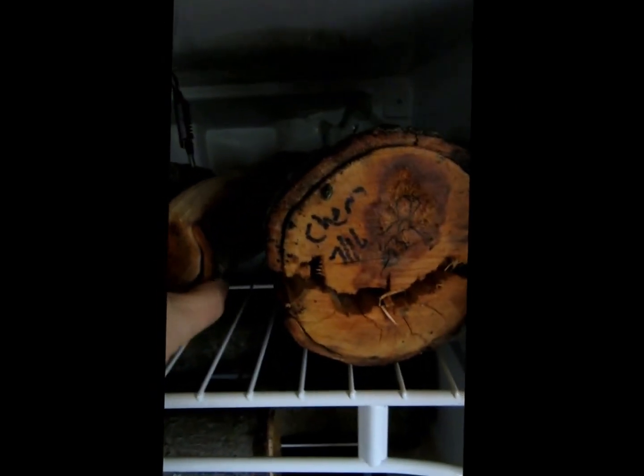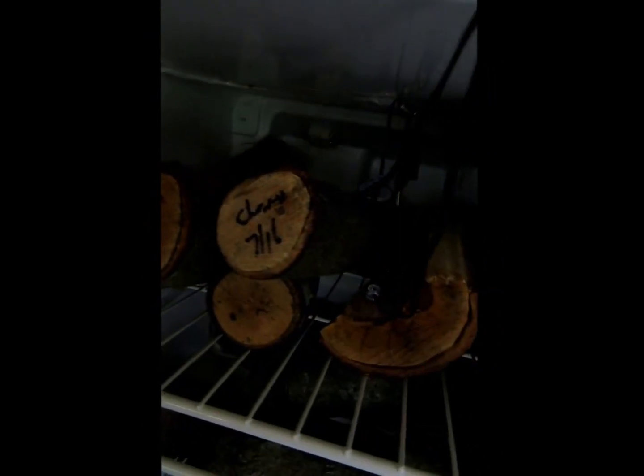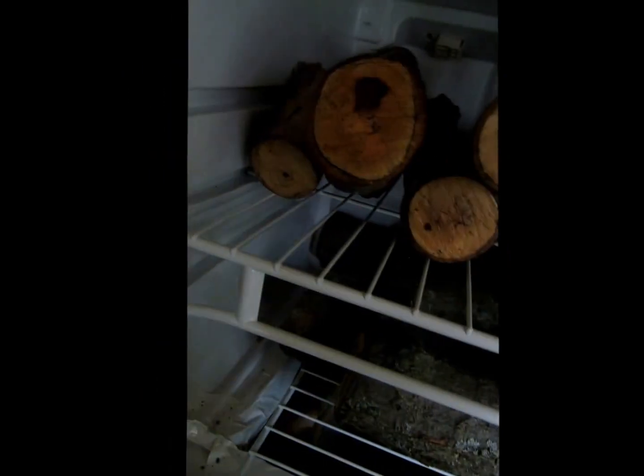The rest of these pieces have come down substantially in moisture. I was checking them and like this one is 10. I've got a moisture meter — poke it in. I was getting down to 7–8 percent, which is my target goal.